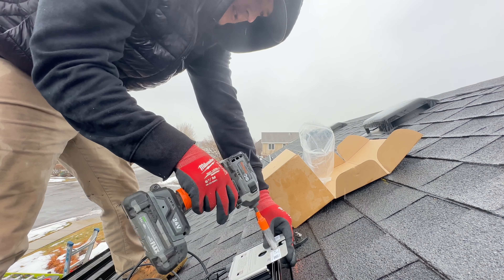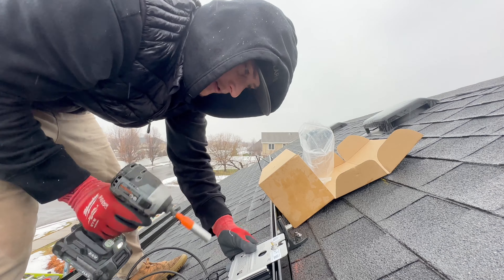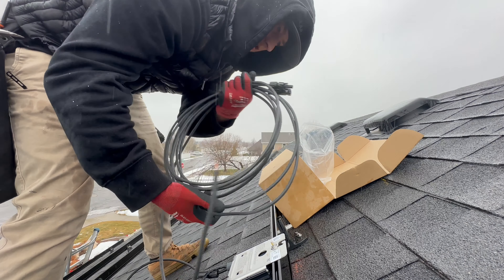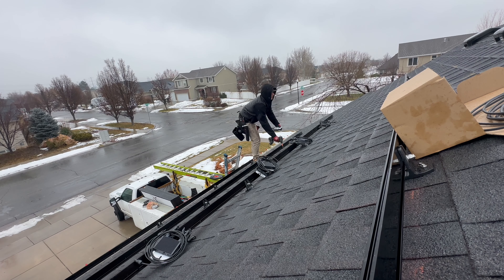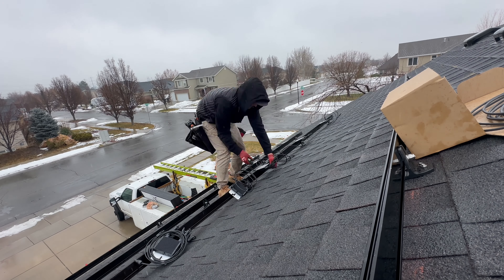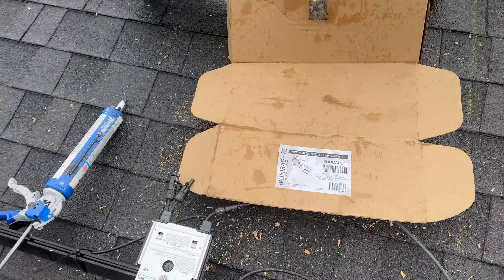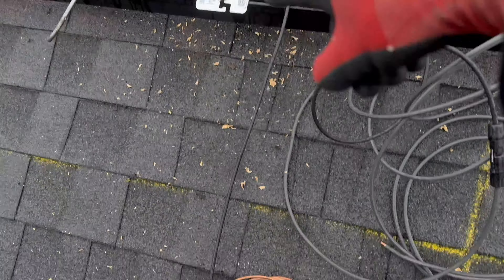This is the inverter system I'm using — SolarEdge has these electronics. I've got these bolts that go on the rail and twist into the channel, and then these get torqued down. I can put the optimizer underneath each panel and center it there. I'm using an impact driver, but in general you want to be kind of careful with these. I have some cables — they plug in for the PV wire for running the rest of the electrical through the system.